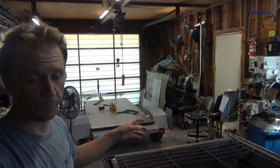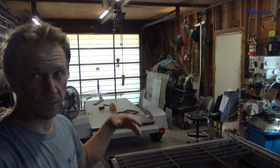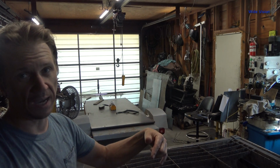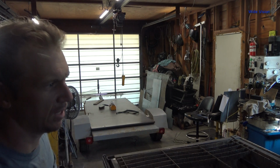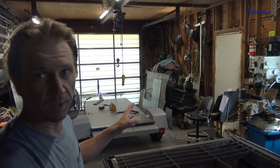This climbing webbing, set up in the configuration I'm using, should be about 6,000 pounds breaking strength. It's 4,000 pounds singular line webbing. By the time you double it over, it should be 8, but then you put it on the knot, which reduces it. It should be about 6,000 pounds before it'll break. So those are going to be more than strong enough with having 3 of them there.